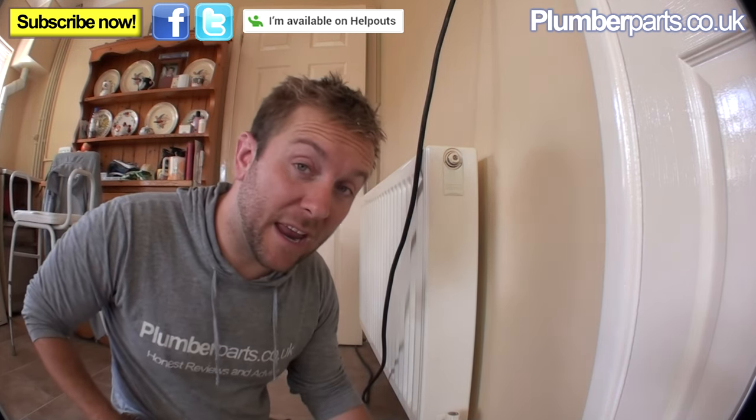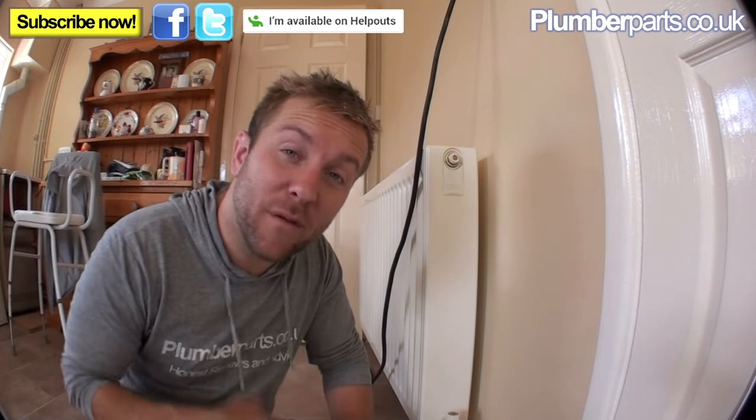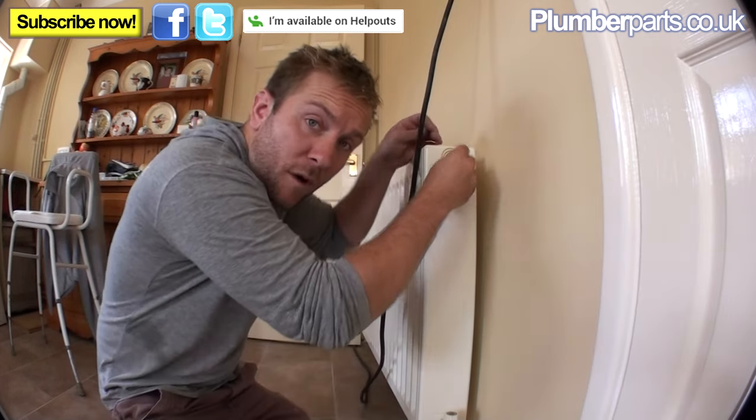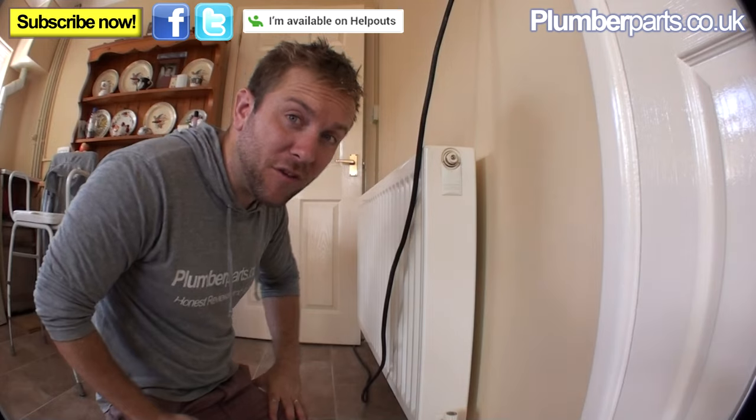As you've probably realised, we've still got our drain off open here, and we've still got all our radiator bleeds open as well. So the first thing we do before we fill up the system is shut all those radiator bleeds. I've got one here — I'm just going to shut that — and go around and methodically shut all of them off before you do anything else.